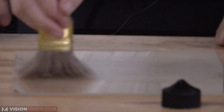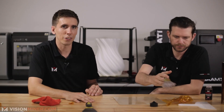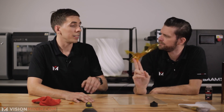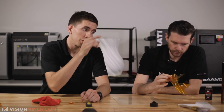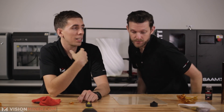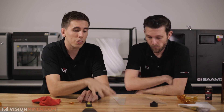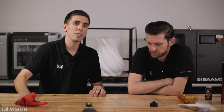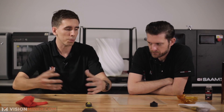So we just went through the whole process. This is how you do it — stick it in the printer and print. It works well. And if you're using ABS, use the Kapton even with the nanopolymer, because ABS is so strong that we break a lot of glass with ABS and glue. Even glue stick will break glass when used with ABS — ABS is the dangerous thing. That's how you use and apply Kapton tape to your 3D printer bed for bed adhesion.